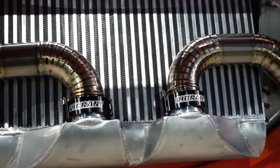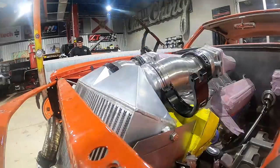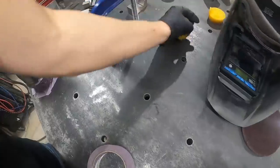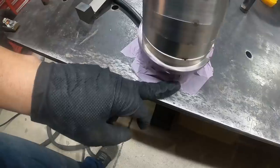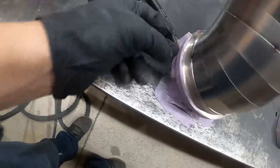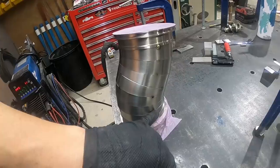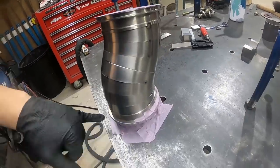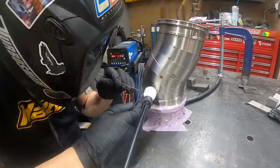Gold on brushed aluminum is just perfect — I'm really happy with how this turned out. We're going to keep welding the four inch uppers, get those back in, and then start laying out our downpipes. I don't have the four inch TIG Aesthetics plugs so I use a four inch piece of aluminum down the bottom with little notches cut so the airline goes in the hole, and I left a little tiny slit so the argon can flow through. We'll go halves on the face, then spin it, change the tape, and get the argon on the other side of our purge block.